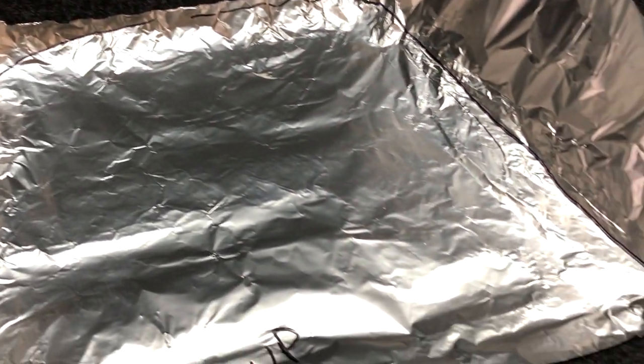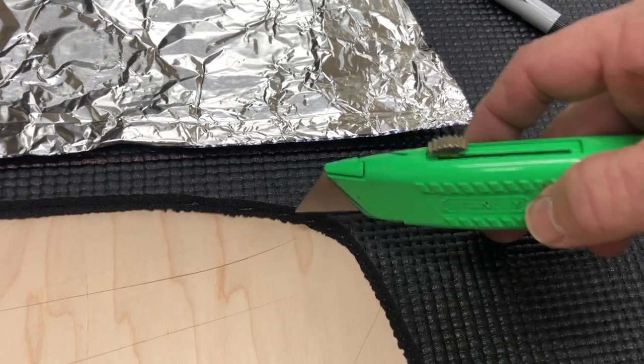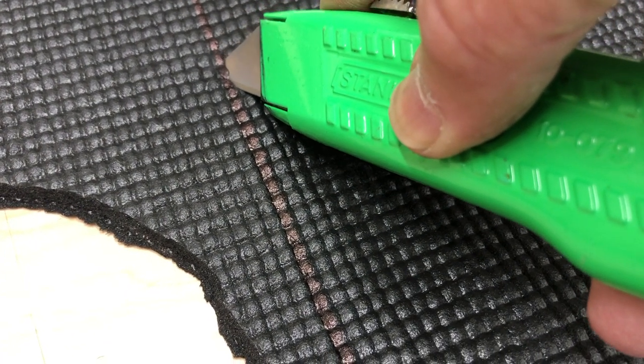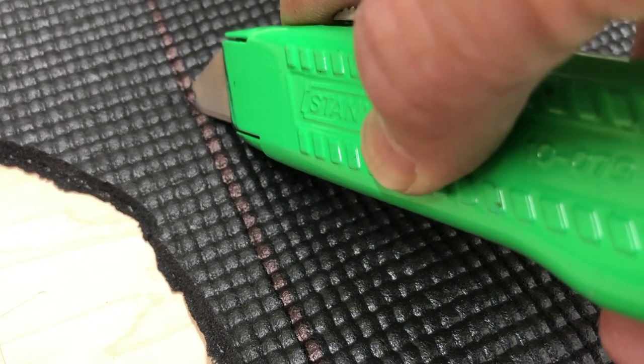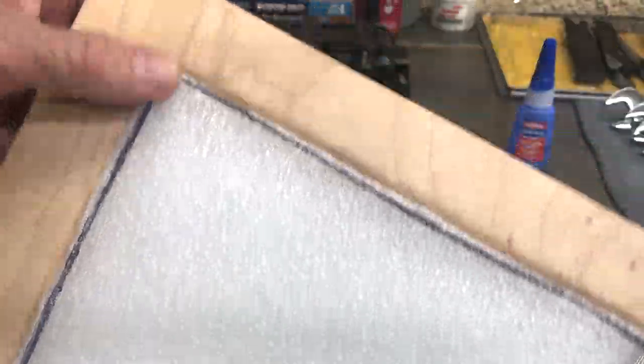While our foam is drying, we're pressing in some aluminum foil to make a template for our rubber mat. We're noting the top side, then taking our template and flipping it upside down and marking it with a sharpie all the way around. Because this is going to be the bottom side - the smallest side of our angle - we're going to cut a real severe angle leaning basically at 45 degrees or greater as we pull and go all the way around. We can also adjust by pulling this backwards to get a different front edge detail on our finished upholstery.